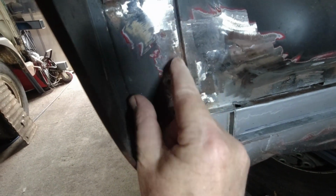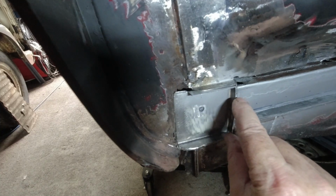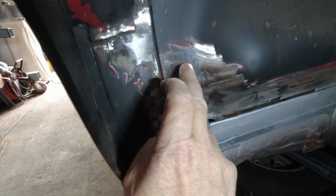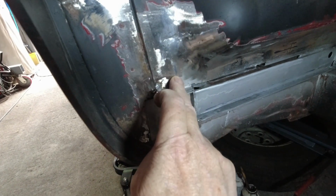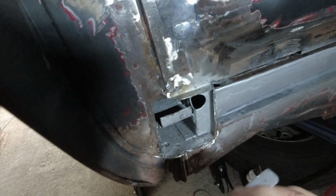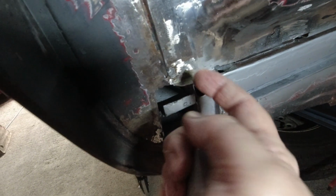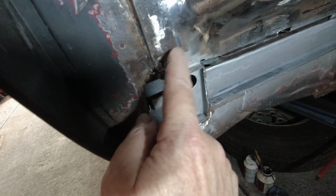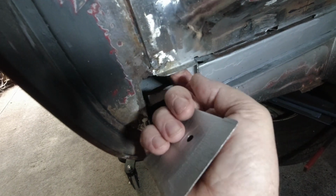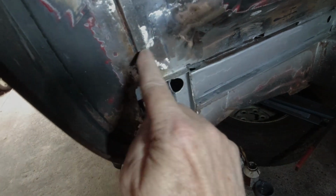Like I said, day one, this whole panel coming down here would have kicked around here like this, with this shape in it. And the bulge panel comes down like it is now and kicks out here. Yeah, this piece. So that's the piece we welded on in the patch panel video. If you check that one out, that's the piece we added onto this piece. Okay.